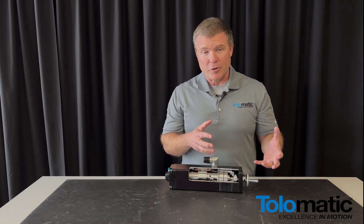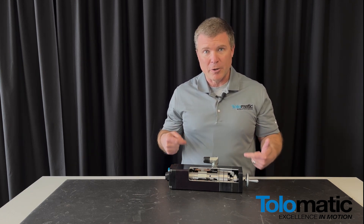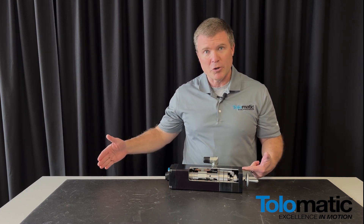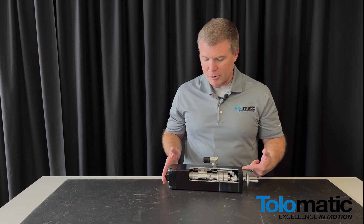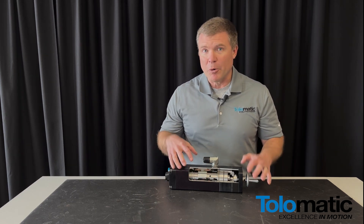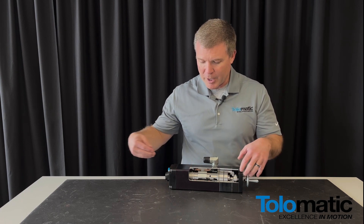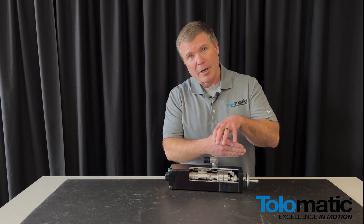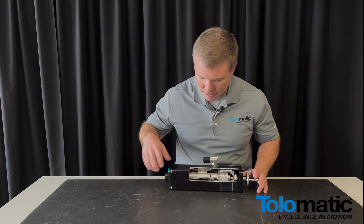What we're doing is we're taking electricity and converting rotational motion into linear motion. We're going to create force capability to either push or to pull with this thrust tube right here. The way that we're going to do that is we have a servo motor embedded inside of here, and then we have a screw assembly that is actually right down the center of that hollow core motor. I'll show you the details of that here.